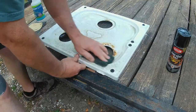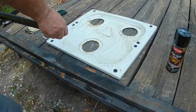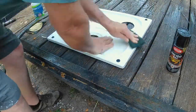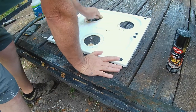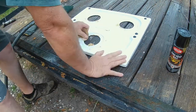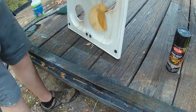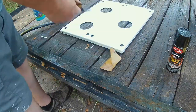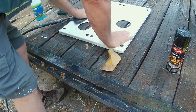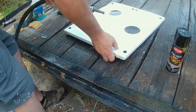What I did first was spray it down with a degreaser and then scrubbed it with the pad to remove all the loose dirt, debris, and old grease from the top. It came out really clean other than the rust areas. On the rust areas I took some 230-grit sandpaper to clean them up the best I could. I didn't want to remove any more paint than necessary, then I used 400-grit wet/dry sandpaper and sanded the whole unit down to give the paint something to stick to.